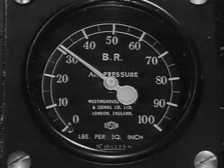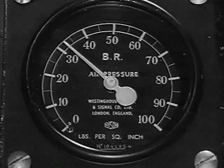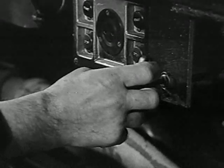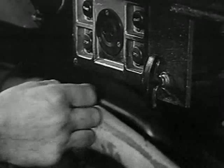As the engine runs, it is also building up air pressure for the control system, because it is driving the air compressor. The throttle must be held open until the engine will run at idling speed. Release it gently and see if the engine does continue to run.